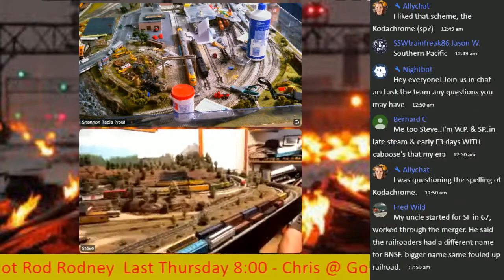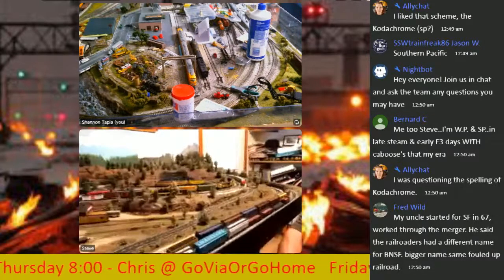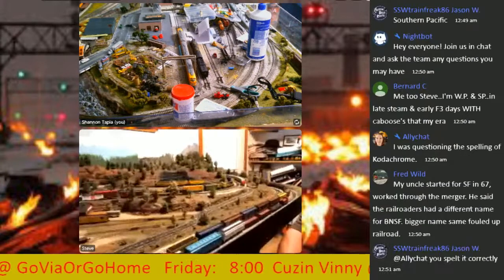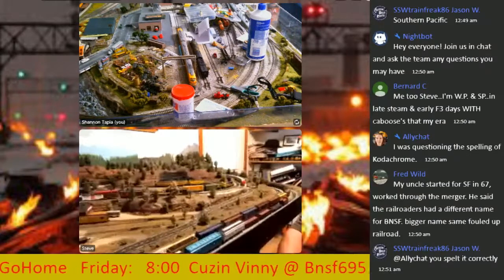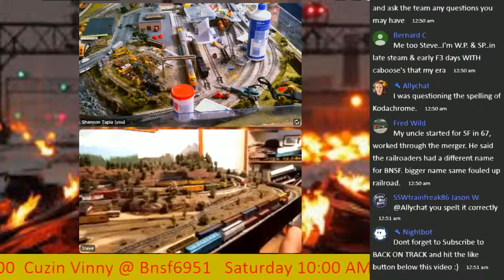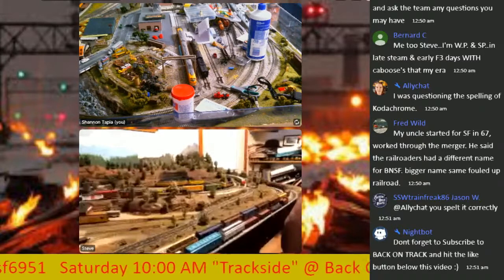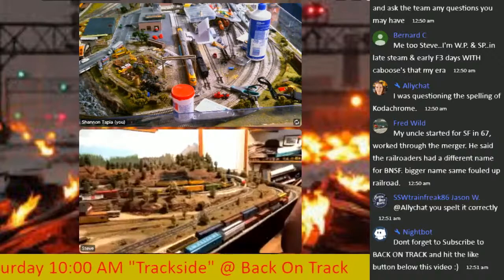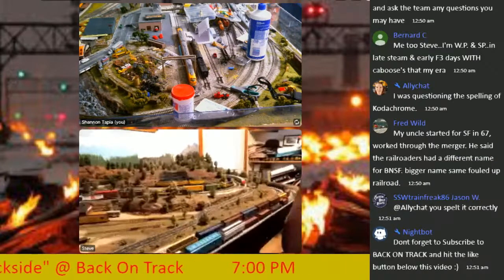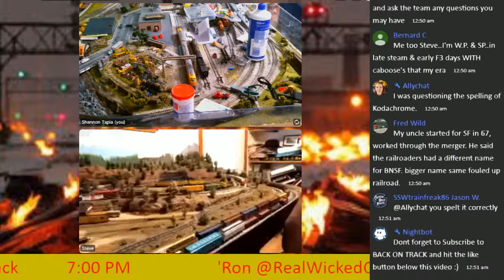And as you're hearing all this, you're looking at the camera, and you can see the two freight cars starting to separate as the front end is still going under power, and the back end is just locking up because there's no air pressure keeping the brakes open. Right. And what happened was a coupler broke out of the chassis. So what does a coupler sit in?